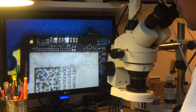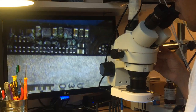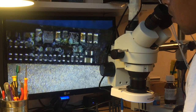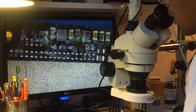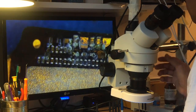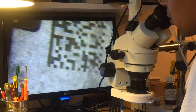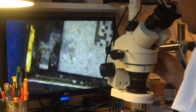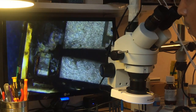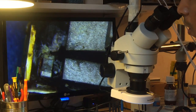Let me get a close picture of these components here up near the Wi-Fi chip — they're really destroyed. Everything is destroyed. As I can see, there are small chips for the camera and these are capacitors and filters that provide the Wi-Fi chip with voltage. So everything is damaged. We know for sure that the phone is shorted and the VCC main is shorted. This capacitor close to the Wi-Fi chip is the most common component that gets damaged when you drop the phone in water.